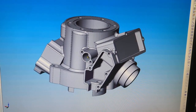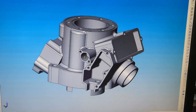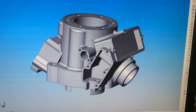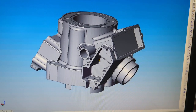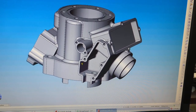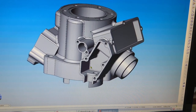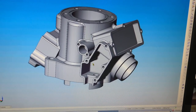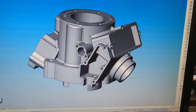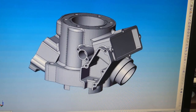Because it's on a road-going bike on an R1, it'll have a real alternator, and it has to have that for fuel injection anyway. So because I have actual wattage from an alternator, I have the ability to make the power valves operate off stepper motors instead of the mechanical governor. On the power valve cavity on the side, I would make a thin stepper drive to drive the push rod for the power valve. That's quite nice because I can program it from the fuel injection — possibly ramp the power valve in and out at a slower rate to tone down the power band a little bit.